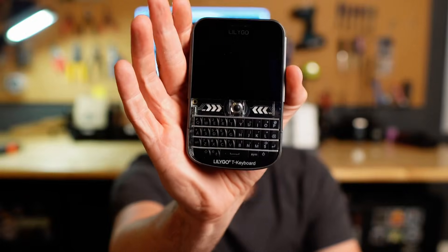So if we're just gonna set it to client anyways, why wouldn't we just use a standard end-user device for our repeater? The main things are suitability to the elements, power capacity, and the antenna — and also the ability to mount it somewhere. There aren't a ton of IP67-rated Meshtastic units, and without dust and water resistance your device is not going to fare well in the elements. I've got a node on top of my house right now that has been through a blizzard, windstorms, hail, and rain — that's because it's resistant to water and dust and debris, and it's been up there for about a year without any hiccups.